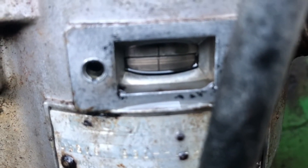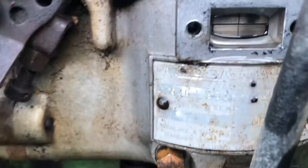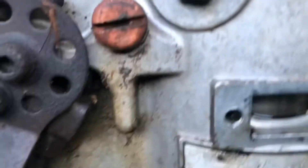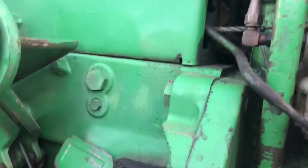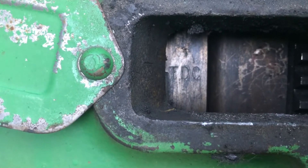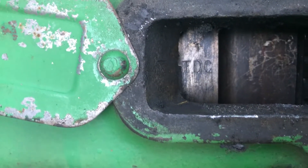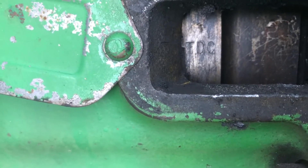It was running all right but I might have to time it a little differently. We're coming around - it's just going to say top dead center right away. That line is basically lined up and my top dead center is exactly where it must be, in the center of the window. You can see it says top dead center.